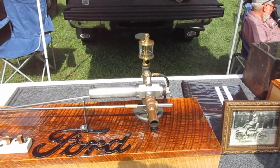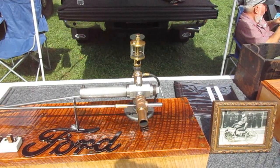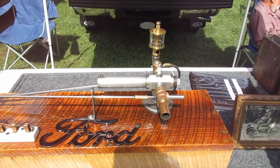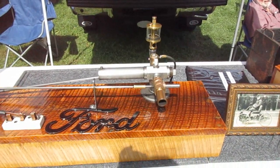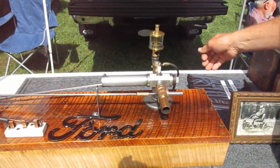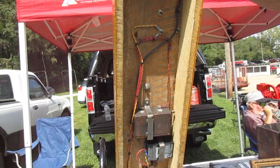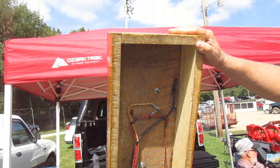The oil hole was completely closed shut and a 20-thousandths drill used to re-drill that, which gives me the right consistency for gas instead of oil — otherwise you get an awfully big drop. In this elbow there's a real fine mesh screen, super fine, double thickness. When the drip goes down to the bottom of the elbow and hits that screen, it atomizes the fuel for the intake. We've put a spark plug in it instead of 110 volts — a six-volt battery and a Model T Ford coil to make it all come together.